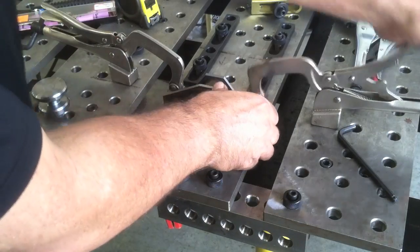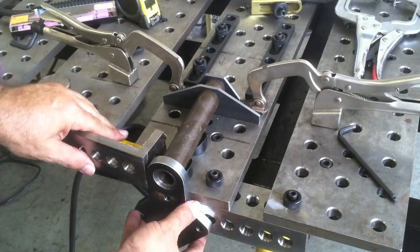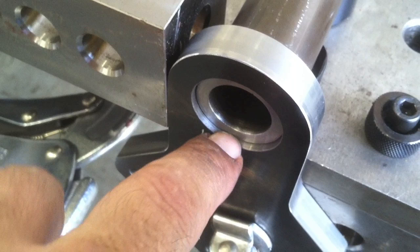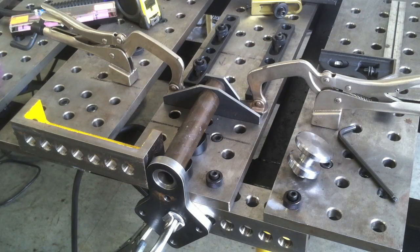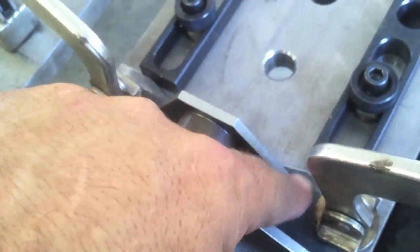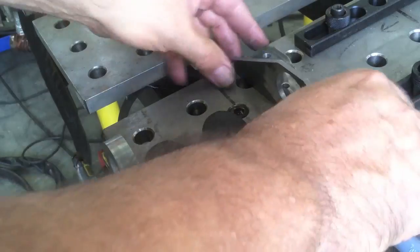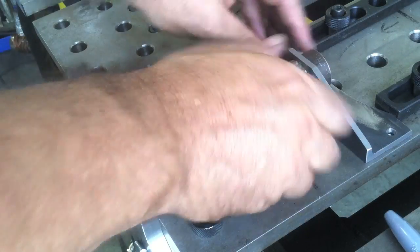That's going to hold that part in place nicely. There's another little gusset that goes back there, and then this piece of half-inch plate that's been machined — it still has a hole that needs to be drilled, but I'm using it for fit-up purposes now. The hole will be drilled while I weld the first part. I'm using an extra riser block as a square — you can use parts of the fixturing kit as tools sometimes. This is hot rolled steel, so there's mill scale involved, and it needs to be TIG welded. I've got to take a grinder and clean off the mill scale off the plate. Through the magic of video, we did that already.